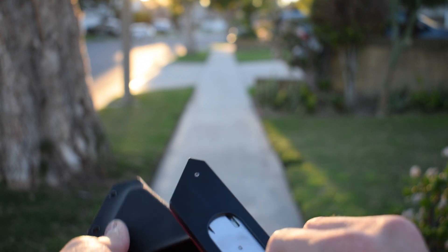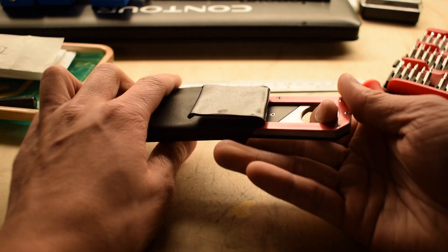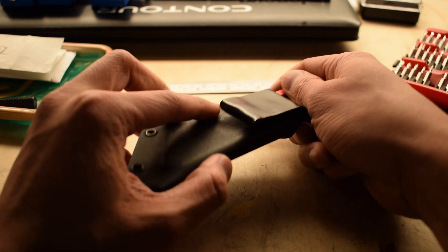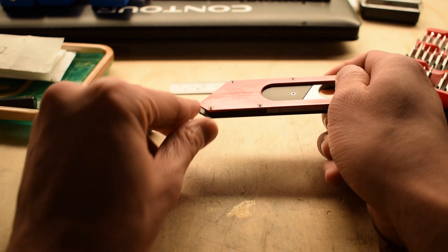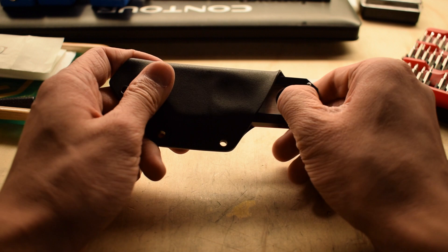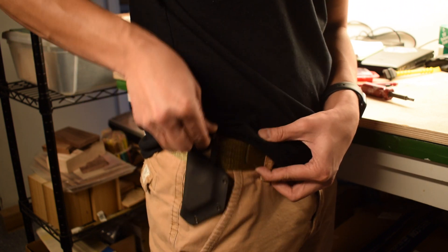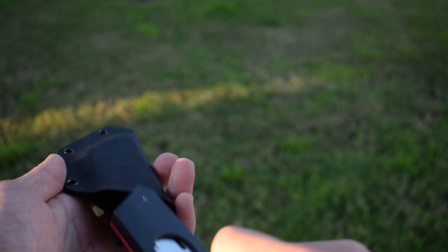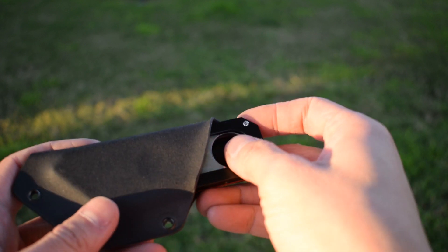The overall process could be improved: I'd machine a maker knife stand-in to form the kydex around so I can control the depth of the retention slot — I only need one side to dip down. I also need to extend the profile so I can grip it from outside the foam press for a snug fit. The belt clip's longevity is uncertain after a couple of weeks, and it slides around a bit, so I may make it a separate piece in future iterations using a third-party clip. Thanks for watching — I'll be back soon with more CNC projects and DIY nonsense.